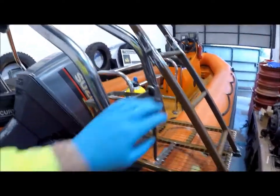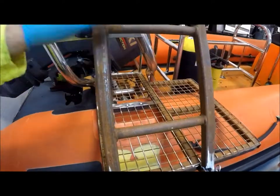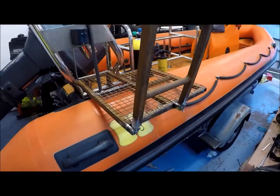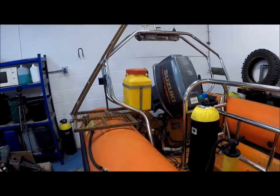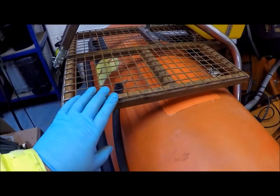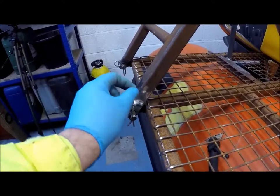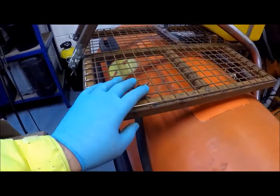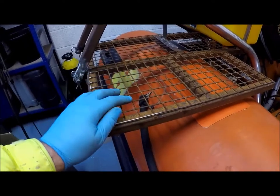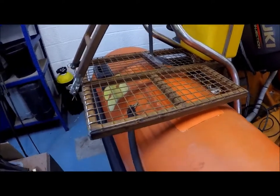When we're on the motorway we'll probably take the ladder off - it's only held on with a couple of clips - put it inside, and then when we launch the boat we'll put the ladder back up so all we have to do is drop it down into the water. It's all rusty at the moment because it is new steel and it got salt on it when we took it out once. You can see where it's shiny where I've done alterations and cleaned it up so there are no sharp edges and no risk of puncturing our dry suits or boots. As soon as I'm confident this is the final design we'll get it galvanized, but I'm pretty confident this is the final version.